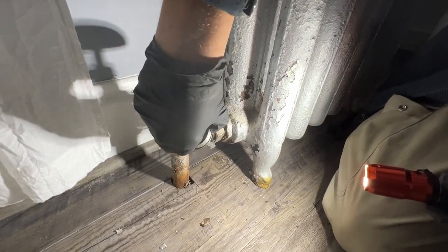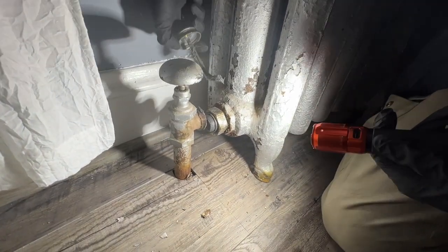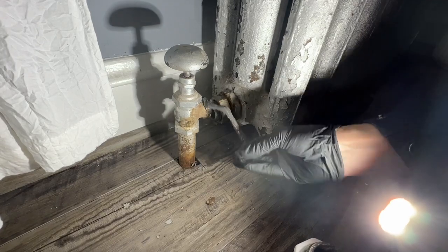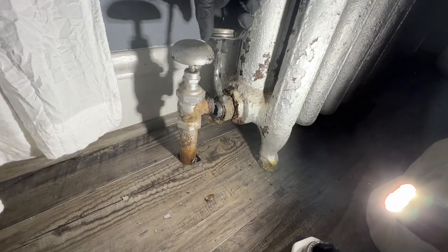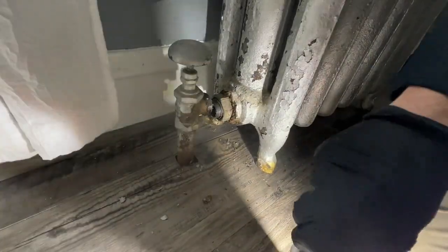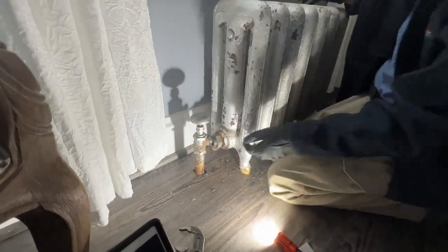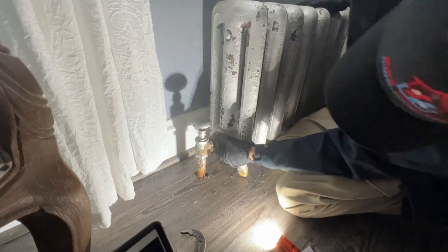I'm applying a very small amount of pipe dope. It gives it more of a chance to seal and I can get more of a turn out of it when it's as tight as I can make it, so that it doesn't seize in the future. I'll put a little on the mating surface and lightly on the threads, then clean up the mess after. They are getting radiator covers, so we're going to try to shim the radiator up a little bit — I can see this pipe wants to be up higher, and I think we might be trapping water in a pipe underneath.